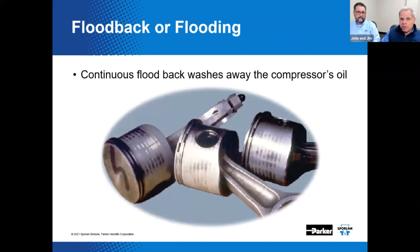Why do we need superheat? Superheat is insurance. It guarantees we are sending vapor back to the compressors. Compressors like to compress vapor — sometimes folks in the trade refer to that device as a pump, but pumps move liquid and compressors compress vapor. Consistent liquid refrigerant — floodback — can damage compressors by washing away the lubricating oil. Floodback leaves a very distinct wear pattern on parts like pistons. Flooding is small to moderate amounts of liquid refrigerant being introduced to the compressor inlet over long periods of time.